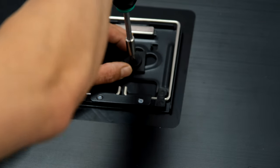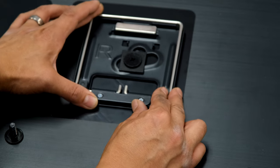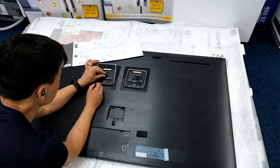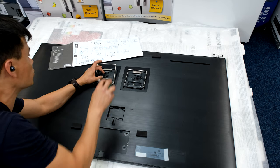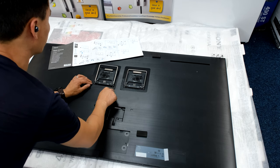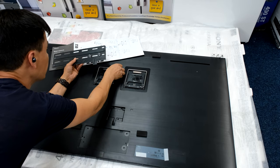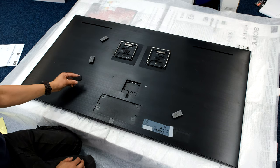This bolt goes through the back of it — B here, marked R — and that screws in. It also tells us don't have it fixed wonky; it wants to be straight. I'll wind that in quickly so it's pretty straight, and we can see the purpose: it slides and moves about, giving us wiggle room to level up. Same for this side — bolt through C2 and D, screws in, keep that plate straight. That's gently nipped up. We can see these things provide a surface to slide about on for leveling, and we can just see those magnets that will engage with the plate on the wall.